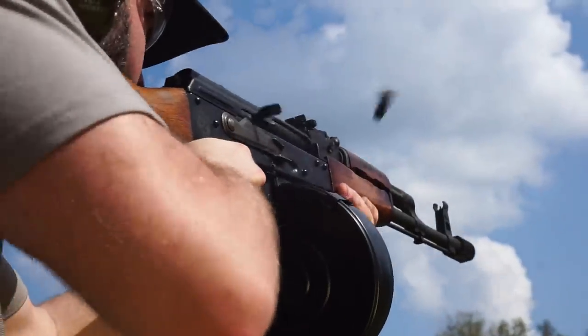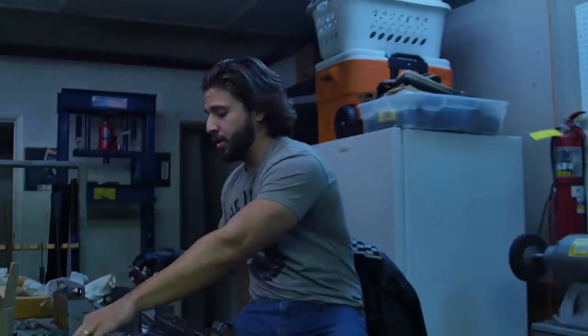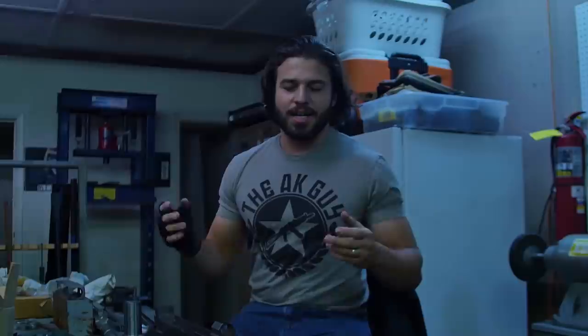So why casting? I figured I owe you guys an explanation on this. I'm one of the biggest guys who rails against cast bolts, cast trunnions, everything like that on a typical AK - that gets a big fucking fail. The reason I'm a big proponent of using forged trunnions is because I don't think casting necessarily has the strength or longevity to hold up under the abuses of what you're gonna put an AK trunnion through. The reason I did it on the AK-50 for the prototype parts is because these are non-stressed parts. The receiver - we actually redesigned it.